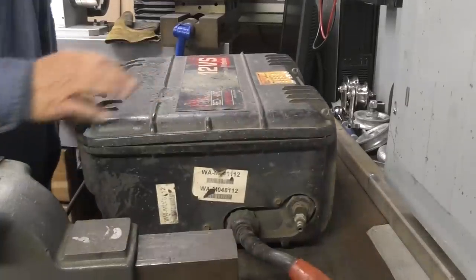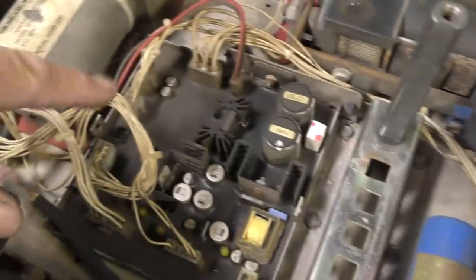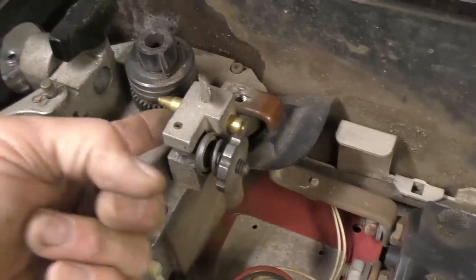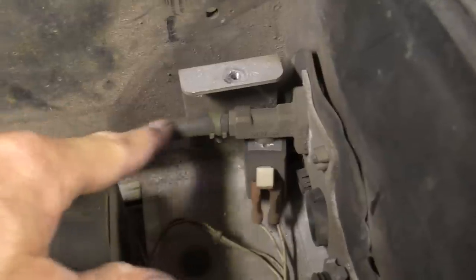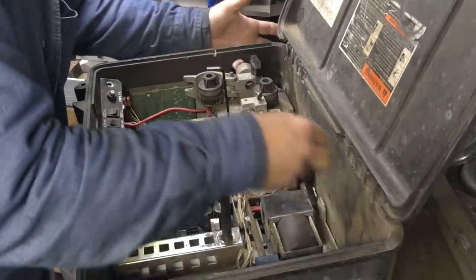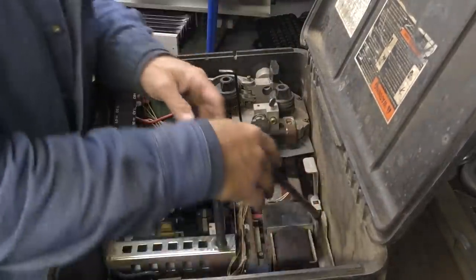This is an 80-pound patient, but mainly that's 40 pounds of wire. There's got to be the controller board. There's the cutoff for the power supply — main power comes in there, runs through this bar. That's a big contactor. It sends power up through the wire, picking it up off the wire from this copper piece. Drive rollers and tensioner, big motor to run the drive rollers. And right over there in the corner — that's our solenoid for the gas. It could be a problem in the hose or the solenoid not opening all the way.